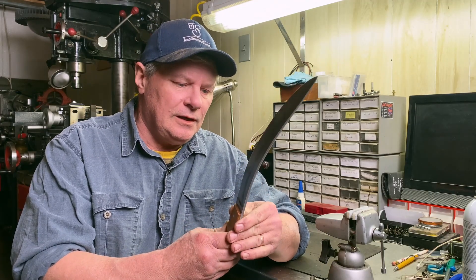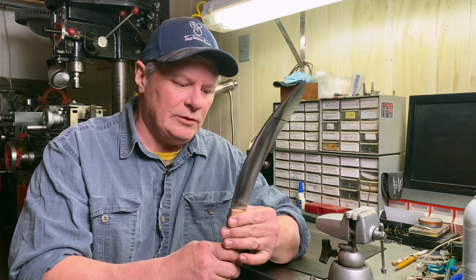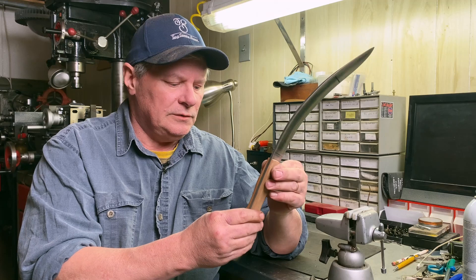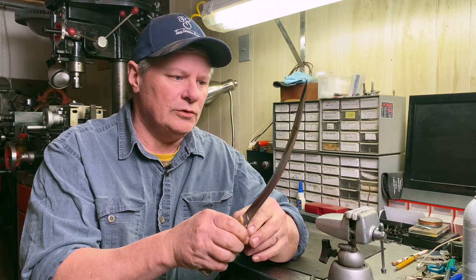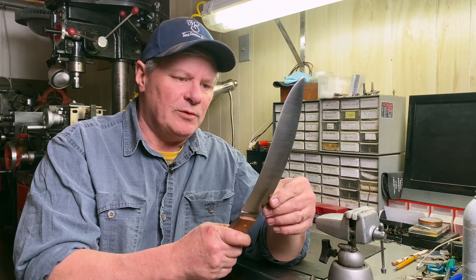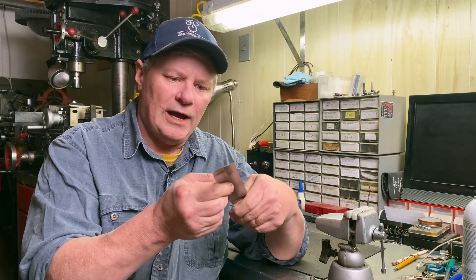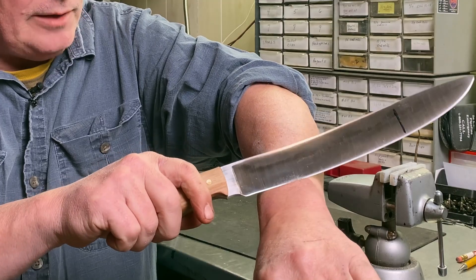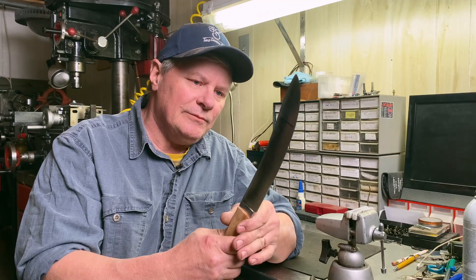Well, lucked out I guess. If I had to do it over again, one of the things I would do is make my handle a little thicker — it was a little too narrow, kind of hard to hold during the chopping. It could be a little wider, but I really like the narrow taper for the bend test. It worked fine — no cracks, no issues. Looks like the heat treat was spot on. It's still shaving — you can see the hair popping there. Anyway, I hope you got something out of this. That was a practice knife; I've got to make the real one next. I'll probably make two more and test another one. Hope that helps somebody out there — we'll see you on the next one where I'll be making some feathered Damascus. Thanks for watching.